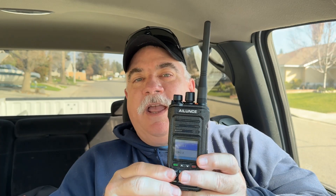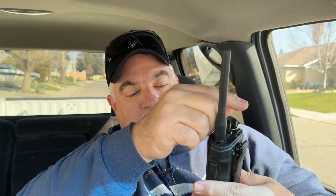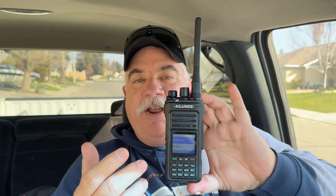Don't even bother with that, because here's the good news. All you need to do to convert your HA1 Golf into an HA1 UV is just download the latest HA1 Golf firmware. Once that's done, when the firmware update is complete, your radio will still be locked into GMRS and it'll still function as a GMRS radio. The only update you'll see is the splash screen will have changed, and then you'll notice right away when the actual display comes up that your text has changed.